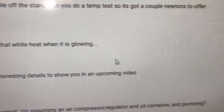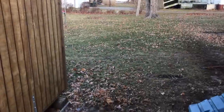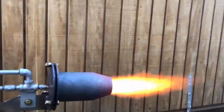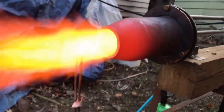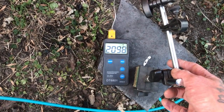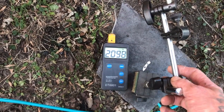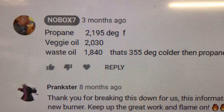This is the comment that Mezcal left, and this was on the silicon carbide burner on propane. You can see there's no smoke, which kind of hints that that's a good thing — it definitely burns the oil very well. We're well over any temperature I even typically get on waste oil. We almost hit 2100 degrees. 2094 is a known record that I have, but that's on a different burner.